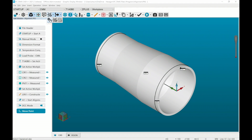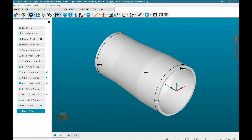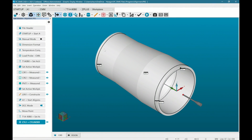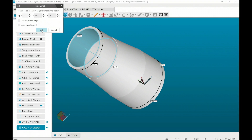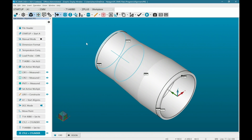I've now activated the clearance cube to automatically move around the part. I'll set this at 100 millimeters to be sure all moves and probe rotations avoid crashing into the part. I will now use quick features on the first cylinder I need to measure to quickly add the feature to my routine using my default measurement and move parameters. Now I will measure the opposite side. Now that I have both cylinders measured, I can finish by constructing the cylinders into a common axis to complete the alignment.